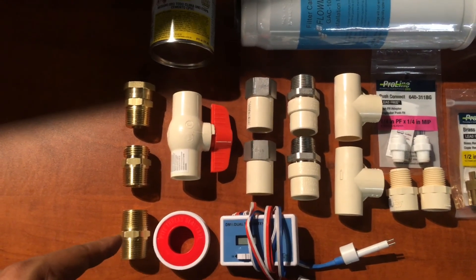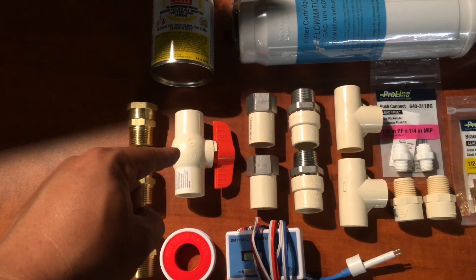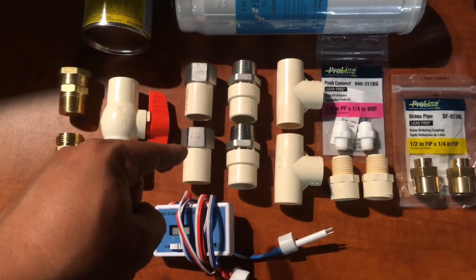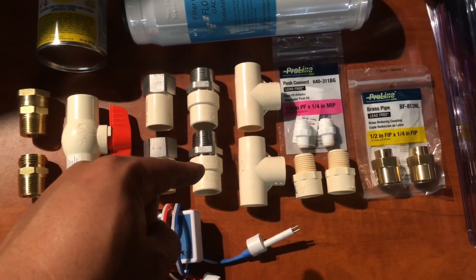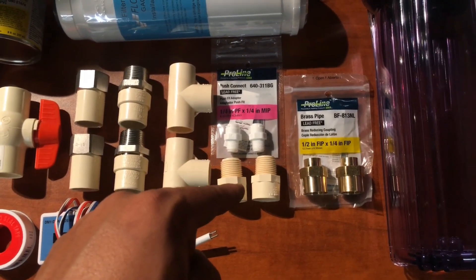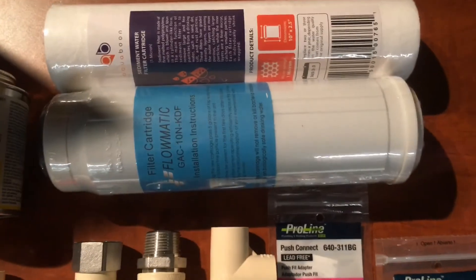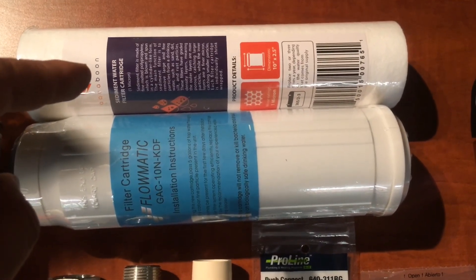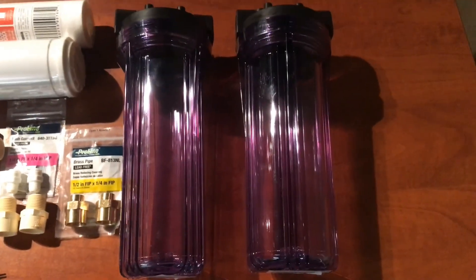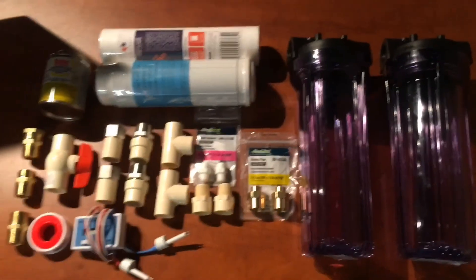For my parts list I have a 3/4 inch brass coupler, as well as the male and female 3/4 inch to hose fittings. I'm going to have a 3/4 inch CPVC ball valve, my Teflon tape, and my TDS meter. I also have the slip to 3/4 inch fittings to connect the hose fittings, two slip-by-slip T's for the TDS meter, and the 3/4 inch to 1/4 inch and 1/4 inch to 1/4 inch reducers to plumb in the probes. I have my two cartridges — a carbon block and a 1-micron filter pre-filter — my CPVC cement, and then the filter housings, which are both 3/4 inch input and output housings.